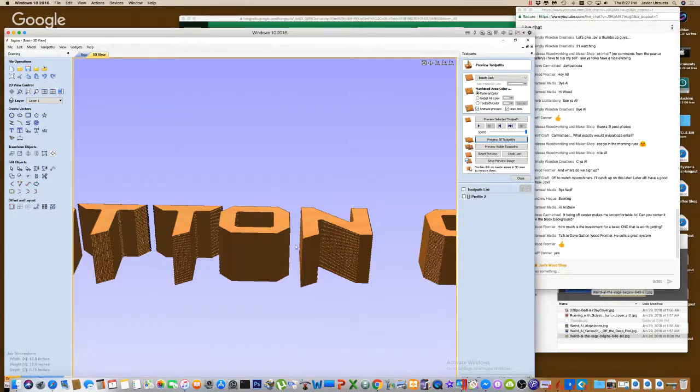And the reason they do this is the following. Their first cut will be at least 3/16 inch deep. Many of you may be asking, how do you get the compression bit in there if the beginning of the bit is an upcut? Because you're going to have to cut layer by layer, and once you start cutting, that first pass will be with the upcut portion of the bit. Well, not if you put the bit deep enough.